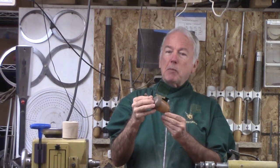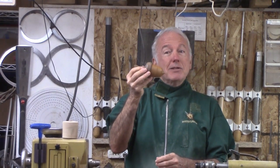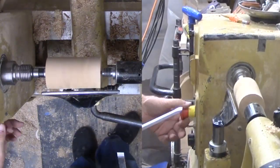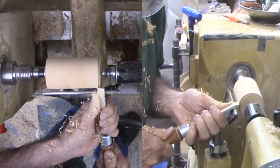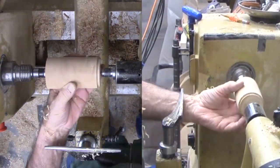I like those bushings so much I put them on my Etsy site. Let's turn this acorn for the challenge. As I finish roughing this block of maple, the remaining task is to cut the dovetail tenon needed for the next step. My favorite tool for this is my skew which cuts the perfect angle almost auto-magically.